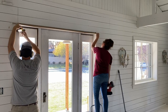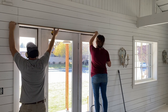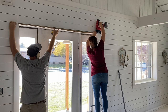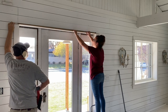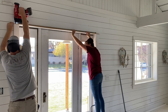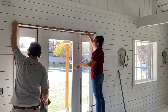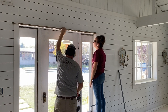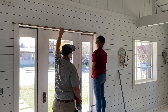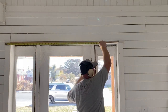Is that about three-quarters of an inch overhang over there? Yes, it is. Go ahead and nail it through the top, just two. It's got a little bit of a wobble going. You need to go back further on your side — it's flush up against the shiplap there. So when we put the trim on we'll just have to push it in, because it's flexible enough — it's just a thin piece of MDF.